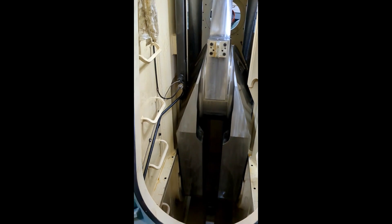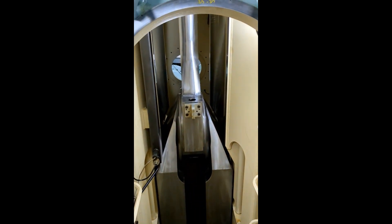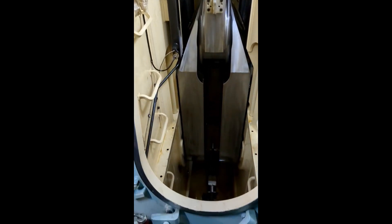Then we turn the unit to TDC. This will shift the weight onto the crank web and shall leave the crosshead clear of the two crosshead supports. After that we can remove the crosshead supports.